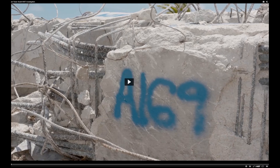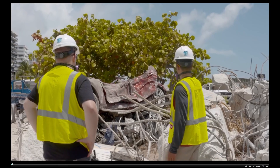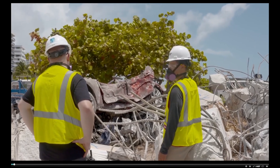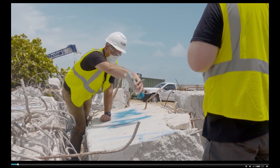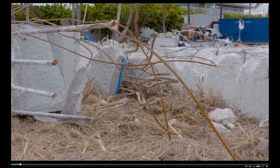I don't understand how they could have gotten away with that unless they got squeezed together after the fact. But this looks to me like it was formed this way. If you put four rebar together like this, getting the concrete to flow in between them — same with these two here — you're asking a lot. This is not going to make a very good, healthy concrete pour. They're basically showing us the same scene from different angles, but I'm going to show you something pretty powerful coming up.